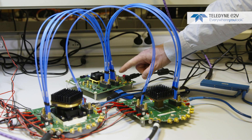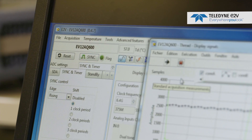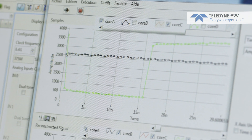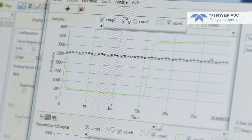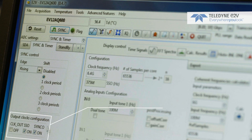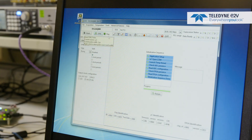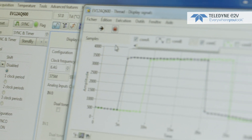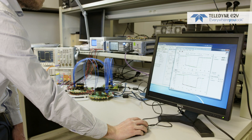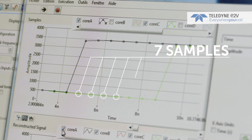The sync signal comes from the FPGA and is sent to the first ADC so that it can be synchronized. The output waveform from ADC one is plotted, whereas the second ADC doesn't output any waveform. When we activate the synchronization chain register, the sync out pulse propagates directly from the first ADC to the second ADC in a deterministic manner, synchronously to the master clock. The output waveforms then show a phase delay linked to the propagation time between the two ADCs.